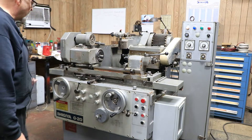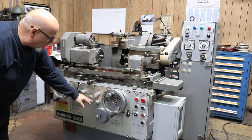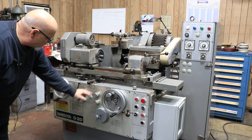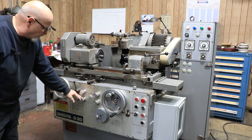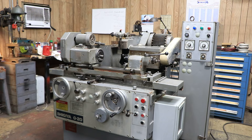Your hand wheels and controls are all here in front. You've got your in-feed for your coarse and your fine. This particular machine has a fine plunge feed and a coarse as well. You have your table speed here, your on and off of the table and a tarry. This wheel down here is for setting your stock removal.